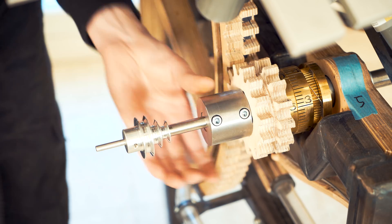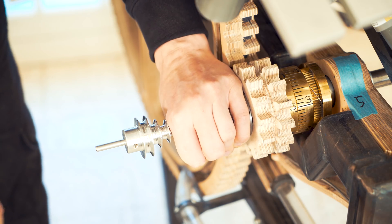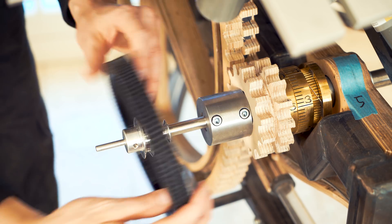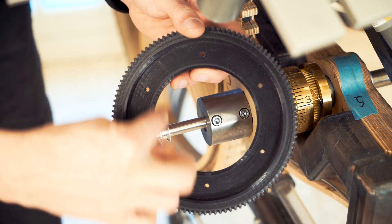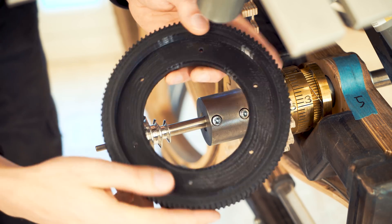Since the electric motor is an afterthought, we have no designated place to attach these pulleys. But Alex came up with the idea that we can attach it right here, and I think this makes a lot of sense. So we're gonna use these screw holes to key the pulley, and now I'm going to make a plywood insert for this 3D printed pulley.